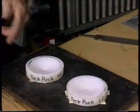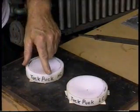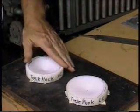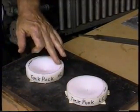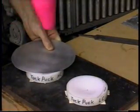What we're going to do — I've drawn a sharpie line around the edge of this Tuck Puck. The top of it is flat so this is a little ridge. We don't want to be hammering up in this area, so all of our work is going to be below this line. We're going to put the metal in and bring it right up to about that line.